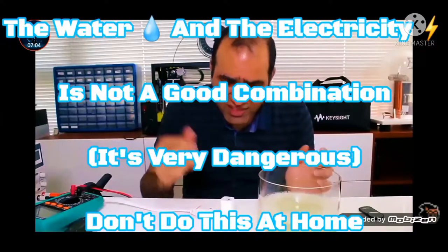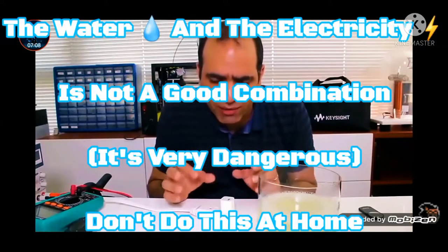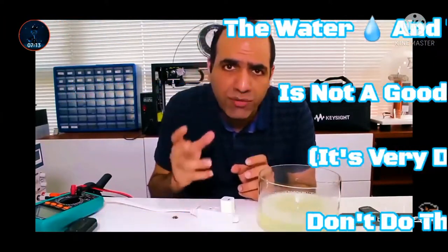This is pretty dead. See, soapy water is much more conductive than regular water. It shorts everything together, and with everything soaked, it just takes the electricity straight from the contacts to your fingers. And with you standing in the tub close to the earth, it runs through your body to earth and can shock you. But I don't think that's what happened either.